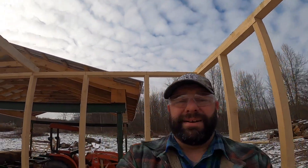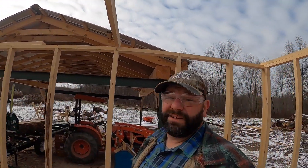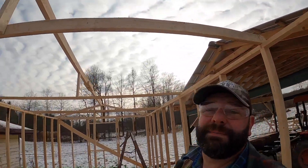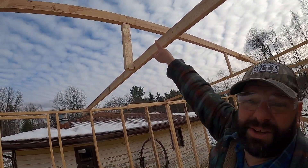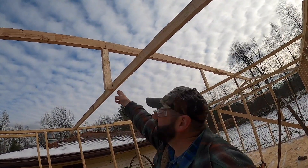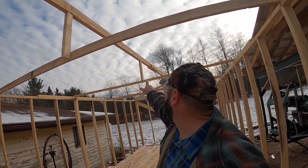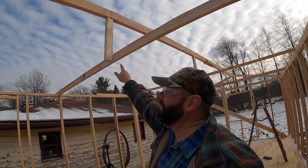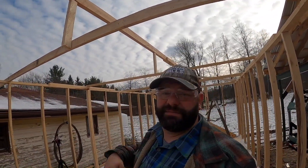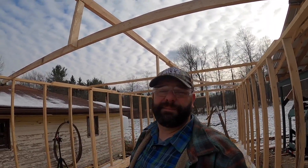So I'm going to go around and nail these top plates on — it's something I forgot to do. I also miscalculated my math on this, which is making my peak a little tall here. So I'm going to pull these nails out and drop it down about an inch and a half, and that should make the ridge even. That's definitely a miscalculation on my part, but I'm not going to bore you with finishing and piecing in 2x4s for the top plate — I'll be right back.